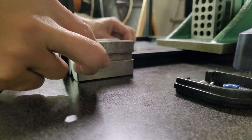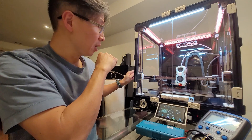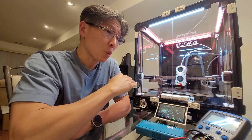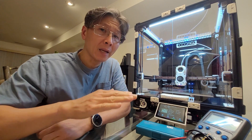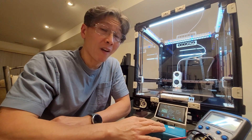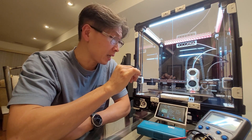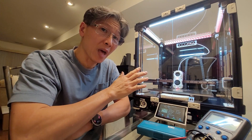When I go online I see people putting some sort of metal backing on the Y extrusion. I asked people why they have that kind of metal on top of the Y extrusion, and they say it helps with deflection — the thermal expansion difference between the steel linear rail and the aluminum extrusion. So that titanium backing plate is meant to help prevent too much deflection. In this video I'm going to show you why we don't need it, and I don't understand why people use that backing plate on their extrusion, because it's going to weigh down their gantry.